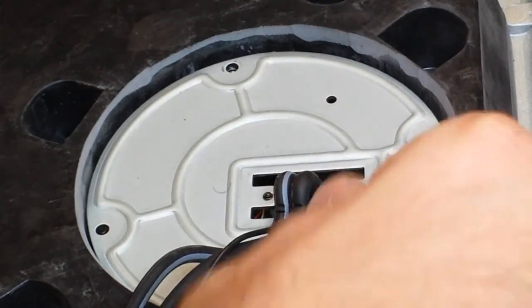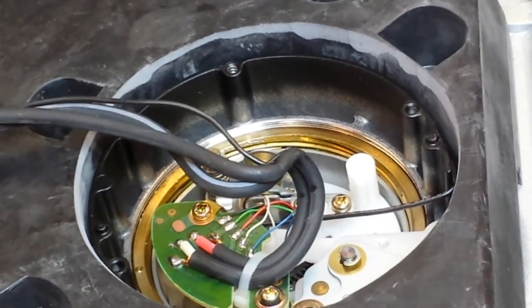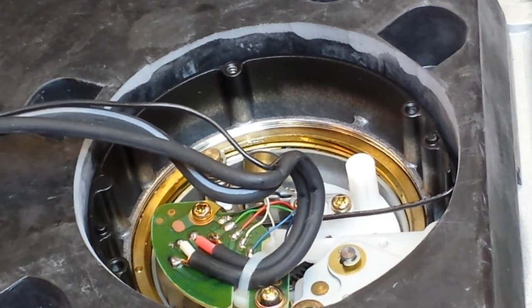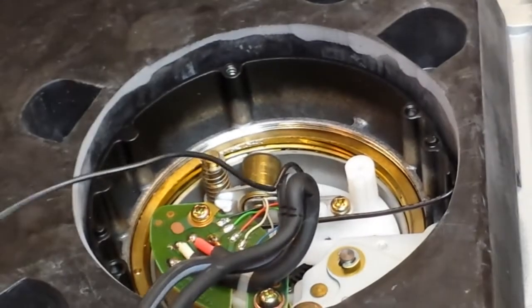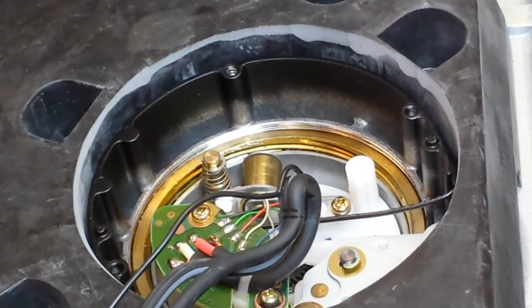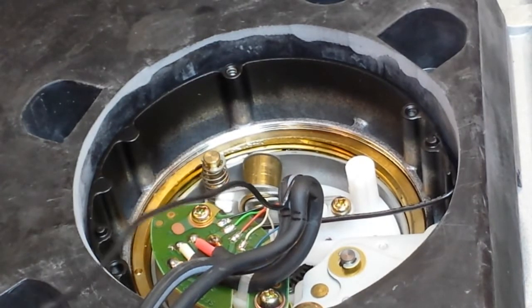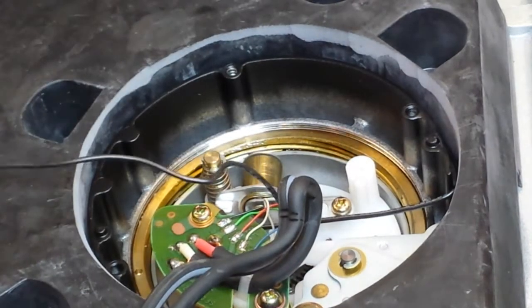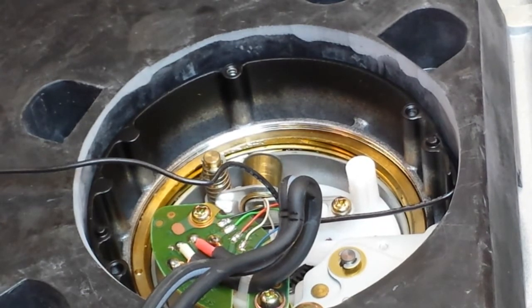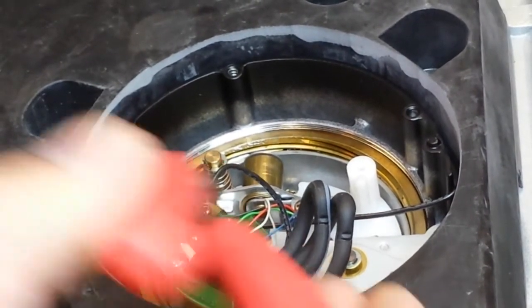Now that you've got that off, pull the plate out. This is going to expose what we're trying to get at, which is the contact plate. I'm just feeding the cables through here so we can get them out of the way. Now you have to decide whether you want to keep your ground wire or not. If you're in a hi-fi sense, it's a good idea to keep it. I personally find it to be a little less hum to unify the ground or internally ground it. So that's what we're going to end up doing. First of all, cut away the old zip tie that's holding the cable down.